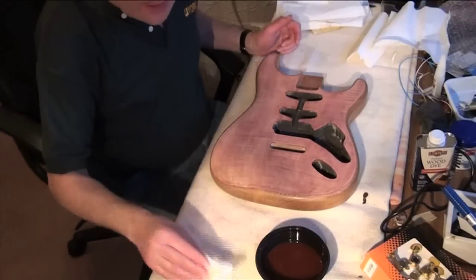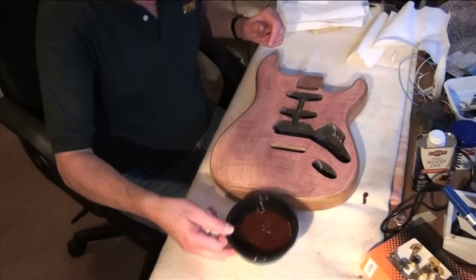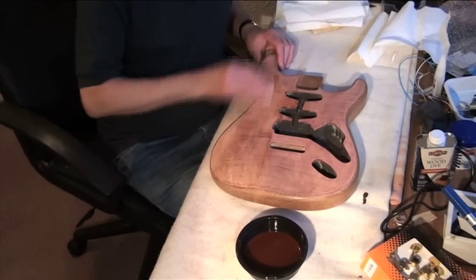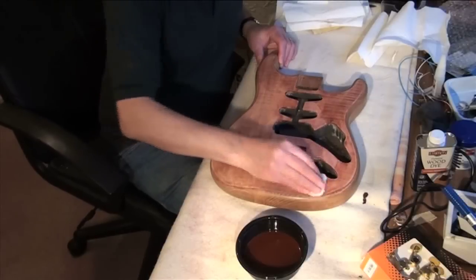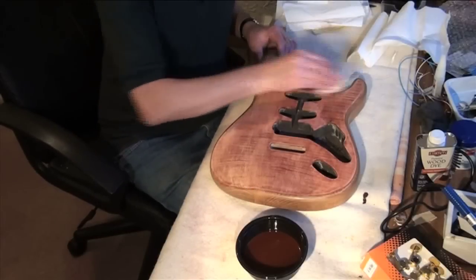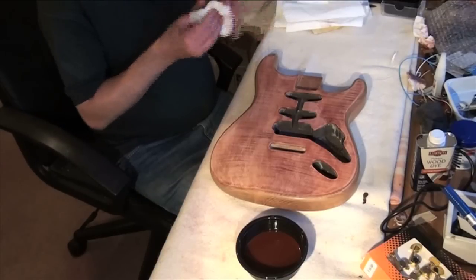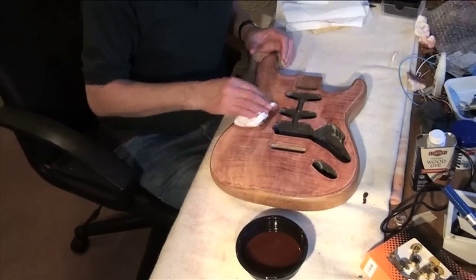Cleaned up the work area and the guitar body, getting rid of surplus dust. I've done a diluted mix of wood dye — it's about 50% the strength of the first coat I put on, the one that I rubbed off. Now I'm just going to damp down the wood here, which shows off the grain rather nicely, but also essentially evens out the porosity of the wood, which should help to even out the absorption of the dye and make for an even more even looking coat. I'm going to take some very soft paper towel, dip it well into the diluted dye, and start applying it.